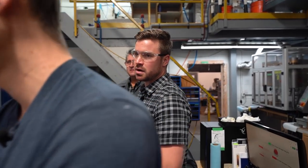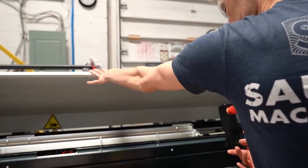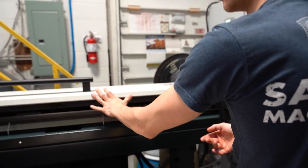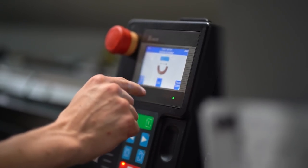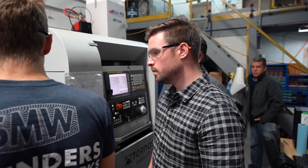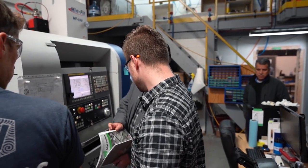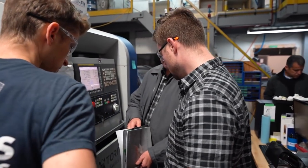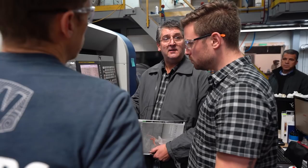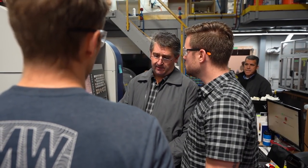So about your bar stock feeder, what's the range you guys have right now for size? Well, this is the G112, so I guess it goes up to 12 millimeter. Okay. I'm putting in 12.7, half inch sometimes, which is fine. Do you know what the range is off the top of your head? I have it right here, actually. So I think you can go 13, but that's with some spindle prep, but 10 is basically standard.